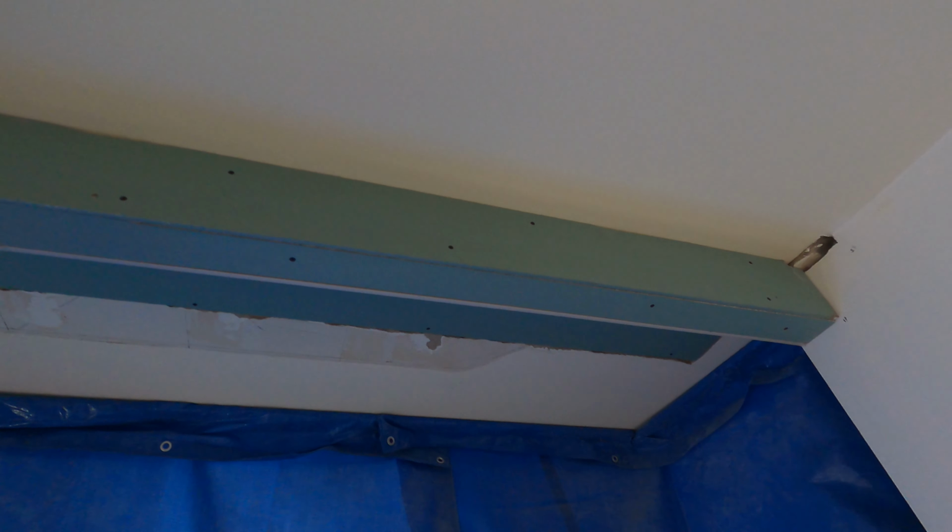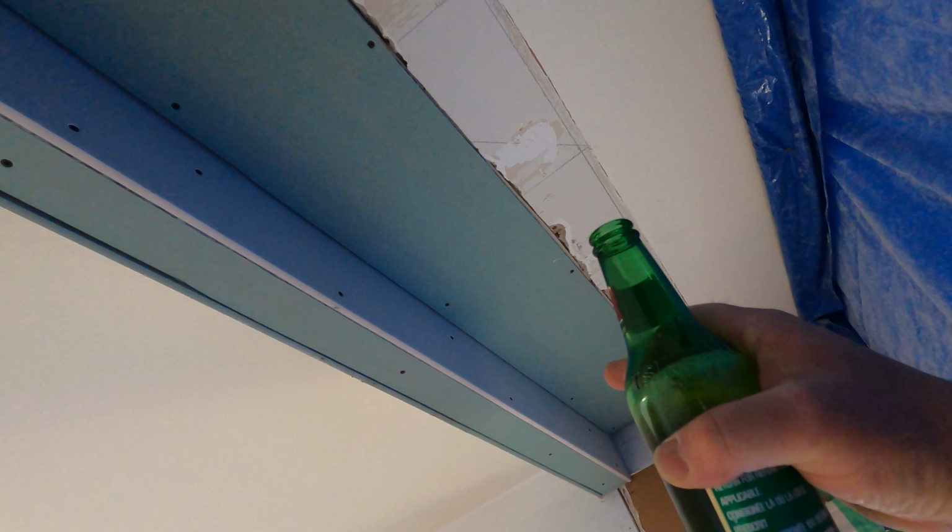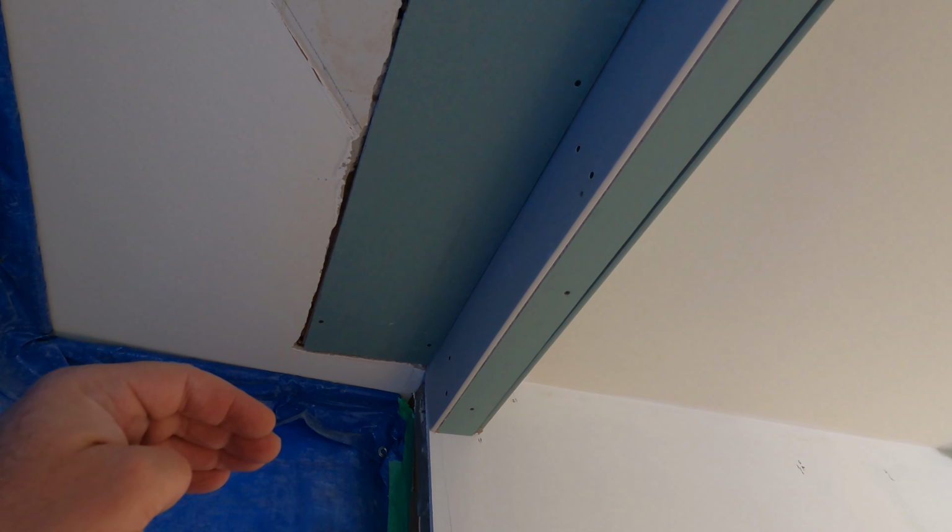Okay, so I got it up. I got it clad. I got this last piece done too. That was a pain because I'm going from plaster to 1/2-inch drywall. So I had to make custom shims. Plus there was a bit of settling of the house over in this corner. Between that point and that point, it had fallen down, but it's weird because there's no cracks in the ceiling. So it must have happened after it was built. But yeah, there's my bulkhead.